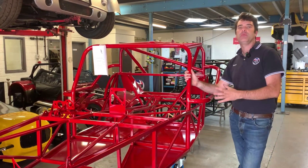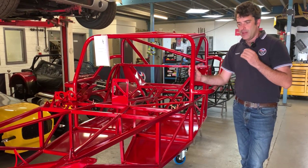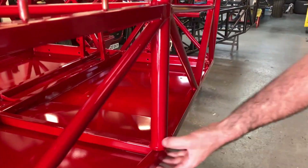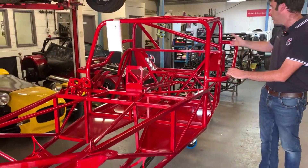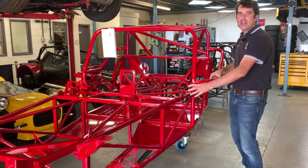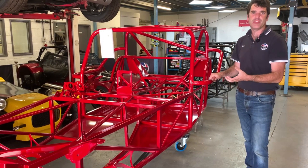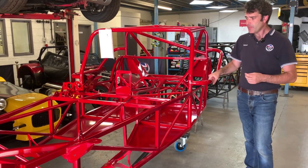The cage on all of the Zeros — when we set out to do the roll cage, we wanted it to be as safe as it could be. The cages are all fully integral to the chassis, so the tube in the chassis is actually replaced by the cage. The cage comes right down and everything ties in, fully triangulated into the chassis, so it's as strong as it can be. I really don't like bolt-on cages — I've seen cases where they weren't fitted correctly, lacked cross tubes, or distorted in an accident. So if we're going to do it, we're going to do it properly.